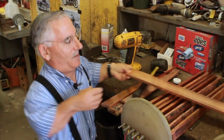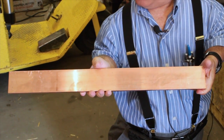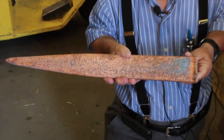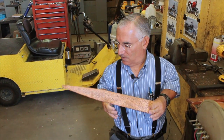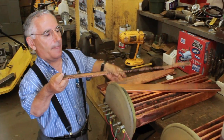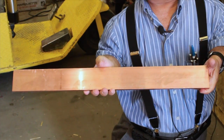This is a brand new pure copper bar — and here's a used bar. They just disintegrate or flake off over time. The copper tanks and bars cost us about $15,000 to install for the whole system, and we've had it for about 10 years. If the copper ionization is not working, the algae that grows on the floor of the greenhouse is rampant. When you use it, you keep it suppressed — so we know it's working.